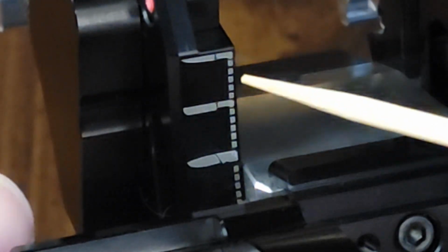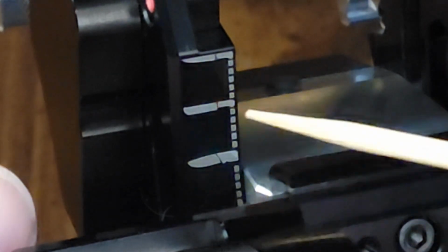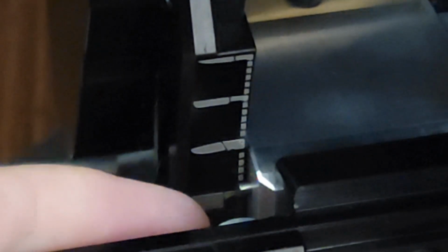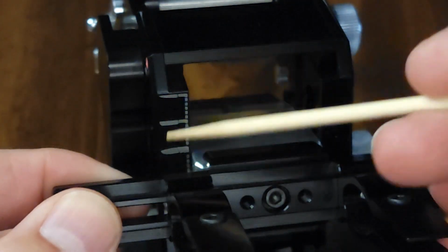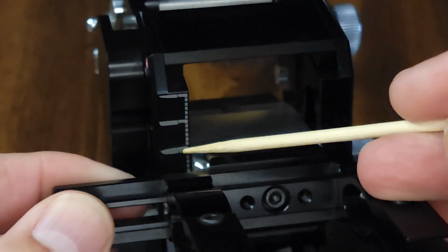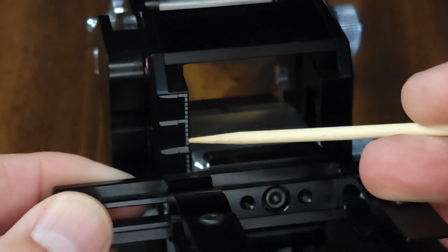It explains in the book what it is, but I'm going to tell you. You're going to start out at 8 degrees, and it goes from 8 to 13 degrees, 13 to 19 degrees, and then it continues on down to 25 degrees. That's going to be your angle. So you can see the pocket knife looking thing right there in the middle, the little silhouette. That's right there at 19 degrees. The notch before it, that's 19. So you can go back 18, 17. You want to put a 17 degree angle on, you're right there.